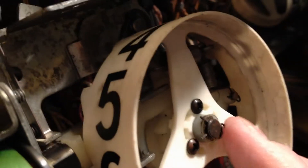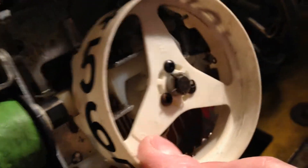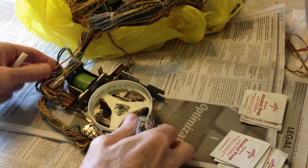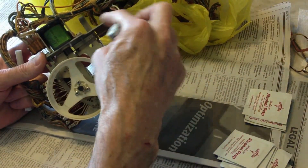I've already taken this apart and cleaned the sleeve, but that didn't seem to do the trick. So it's time to take apart the whole score reel. The first thing we're going to do is take off this little clip right here. Then these three screws come off, and we're going to take it apart. You leave everything connected — there's no reason to cut the wires or desolder anything.